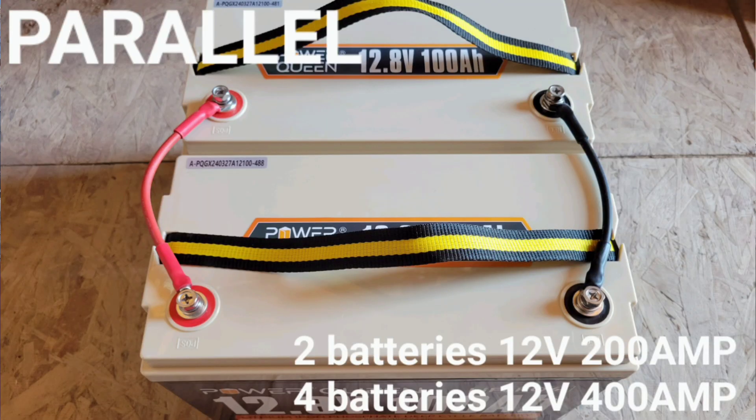In a completely different system in your camper van, it might be 12 volts, so you'd want to run those batteries in parallel to maintain the 12 volts and increase the amperage. 12 volt systems require the heaviest wire — you want around a 2 gauge wire at that low voltage. The higher in voltage you go, a 48 volt system could technically be run on 10 gauge wire.